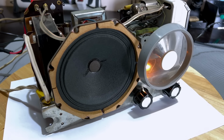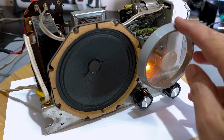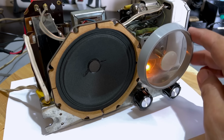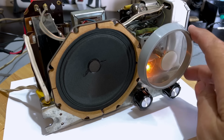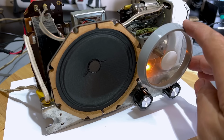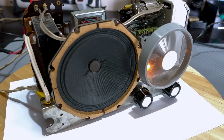And I'm going to change the antenna switch to mini whip. This is where I've got a bit of a problem. This is crazy. The only station I receive is the local station, and I receive it very, very badly. Now, I'm not sure why. I'm going to try and swap out some tubes. It's a hell of a lot easier than testing all of them. And see if it makes any difference, and I'll report back.